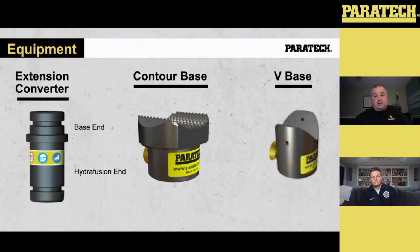Nail holes are there in case we can use this in maybe a structural collapse application or even in a car application where we've got a piece of 4x4 up against a curb and we put a couple of nails in that base that sticks to the 4x4. So then the 4x4 gives you low displacement when you're stabilizing whatever you need to stabilize.